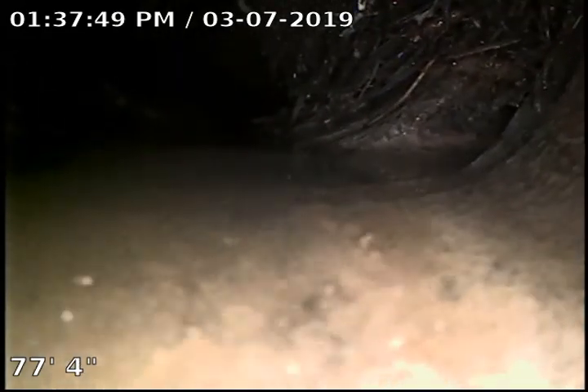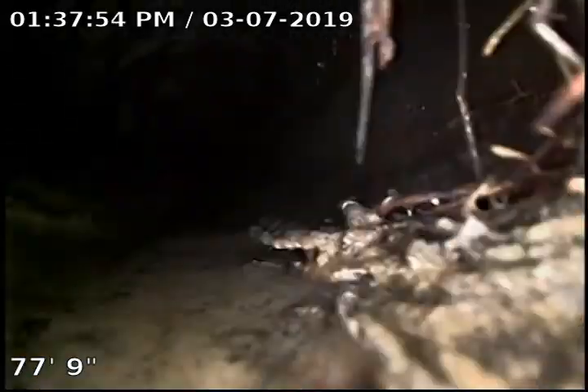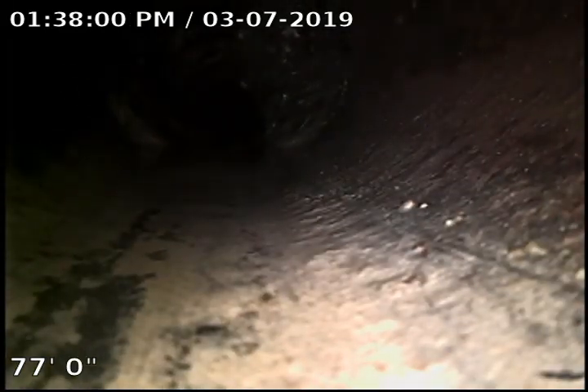Got a little bit of water on it — just flushed the toilet. We've got a few roots right here and a slight separation in the pipe that you can see on the right. Nothing major. There's a tiny bit of buildup in the water there but it's less than a quarter of an inch, so it's not really that big of an issue.